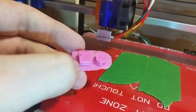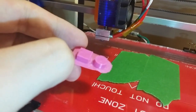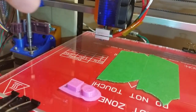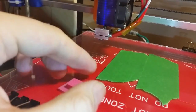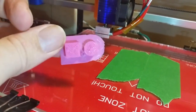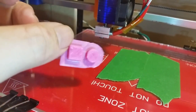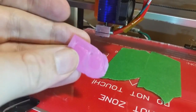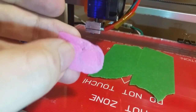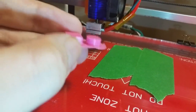I'm just going to cut this early and upload it in a couple minutes. It's printed now. I'll surely try some more — it would be nice to do a calibration cube, and then maybe a Benchy. By a minute, I mean probably a day or two. If you have any questions or comments, please don't hesitate to put them below. For all of you that have helped me directly through YouTube or through your own channels — a whole bunch of people — really good, lots of help. Got this Frankenprinter running, pretty awesome. There is a bit of warping — it lifted. That's just green painter's tape; I really should have had some freshly cleaned kapton on. I really wasn't expecting it to print, and on top of that the nozzle wasn't even at the right height — it wasn't fully leveled to the bed — and it just printed anyhow.